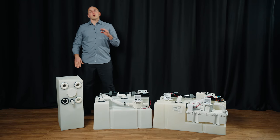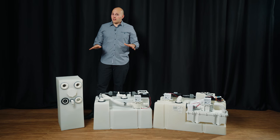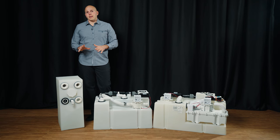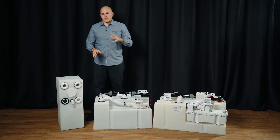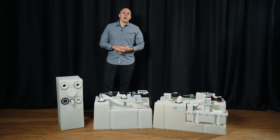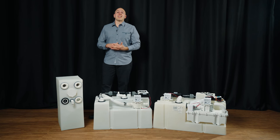A tank saver is a critical part of the tank — it prevents implosion. As you're either discharging overboard when legally allowed, or getting pumped out dockside, this allows air to enter into your holding tank. Some people take polyethylene flat sheets and weld them to make a custom holding tank. If you have to do it, you have to do it, but rotationally molded tanks usually last the entire life of the vessel.